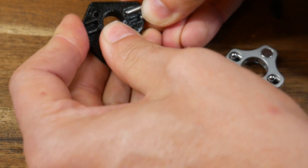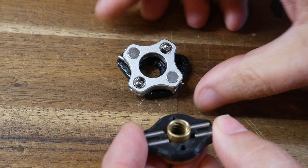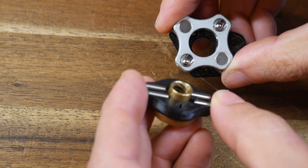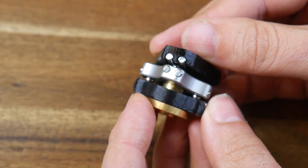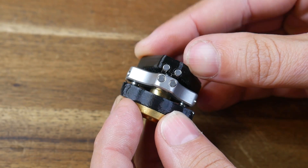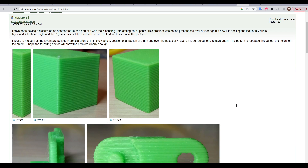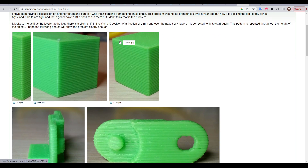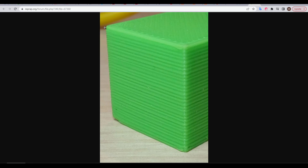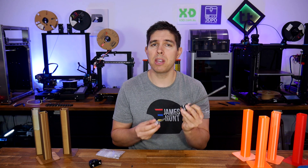Let's preview operation by inserting the remaining pins in a printed adapter piece. The Z-axis nut will go on one side, and the other half will bolt to the top of the printer. If we articulate the mechanism, we can see that all of the degrees of freedom promised in the animation exist on the real product. That means that if the lead screw is bent or misaligned, it won't shift position as the Z-axis travels up, causing vertical ripples in the walls of the print. On paper, this is an ideal solution to correct any misalignment or bent lead screws.